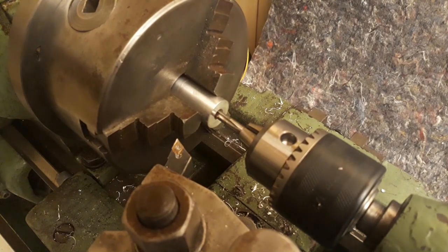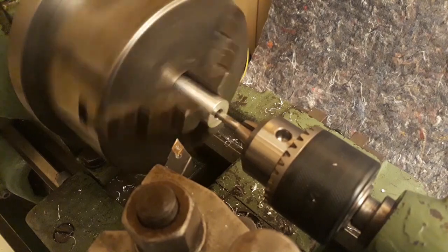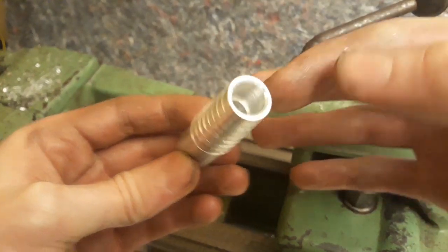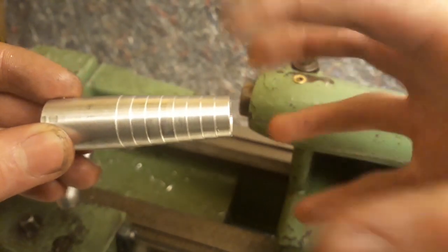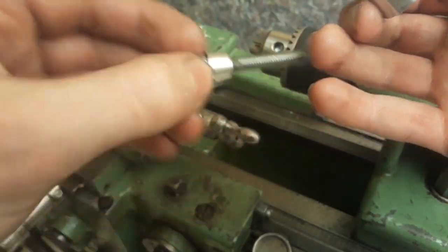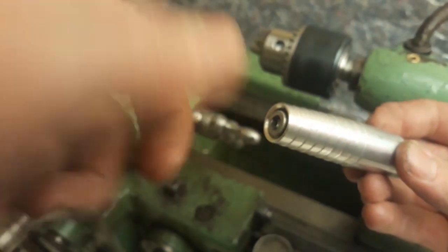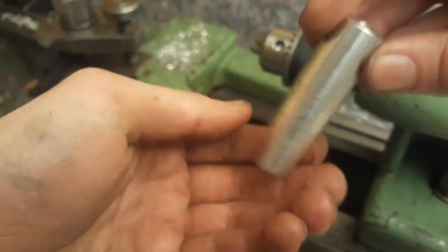Now the tap — this is an M6 screw. As you can see there's a step in here, and we'll now turn a piece which gets in there and wedges itself in there and expands the whole thing. I've got this little piece threaded on the screw — that's the little step in there. When you thread in the screw, this should expand the whole thing. But of course, this won't work until we put some slots in here.